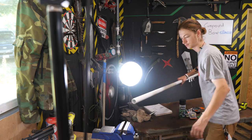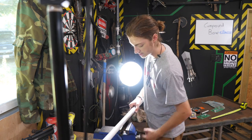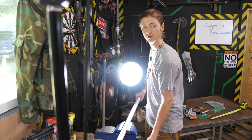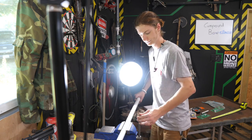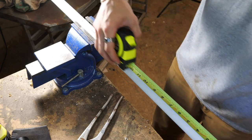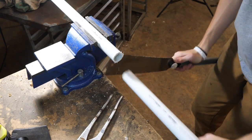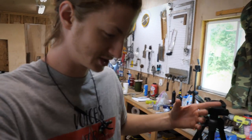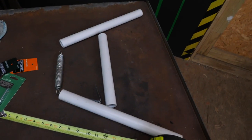Let's start out by cutting our one-inch diameter PVC pipe into three sections: one section a foot long and two sections 15 inches long. Actually, instead of trying the two-springs idea first, I'm going to do the one-spring idea, because it's easier to switch it around to make it work with two springs than to start with two springs and then go to one, because then we'd have extra holes and whatnot.